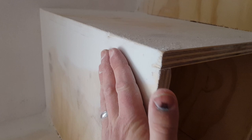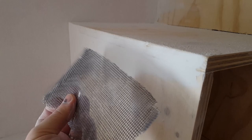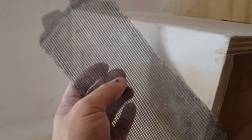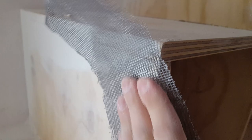So one of the things that I found, I mentioned in earlier videos, and this is just regular drywall putty or drywall compound, but I really like using these sanding screens better than anything else. They last you way longer than sandpaper. They do a lot quicker job, and they don't get clogged up. So there's different screen sizes or grits you can get, and obviously you want to start with your heaviest and go to your finest, but I usually just pick one in the middle and go from there. But they work really well and make quick work of the sanding down, especially large areas.